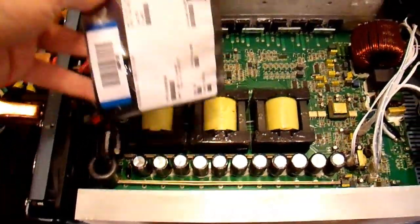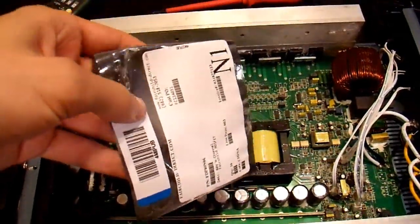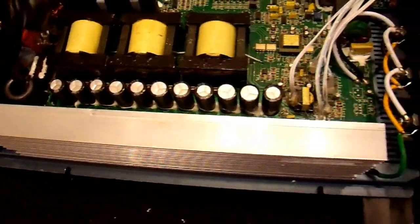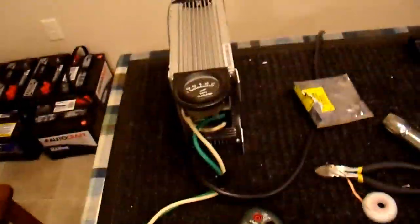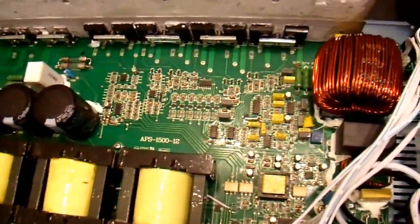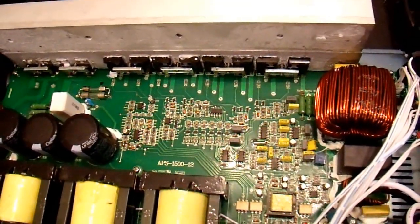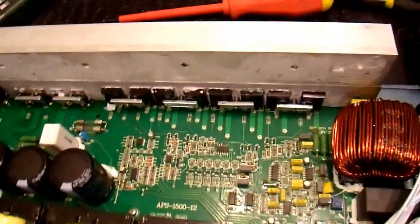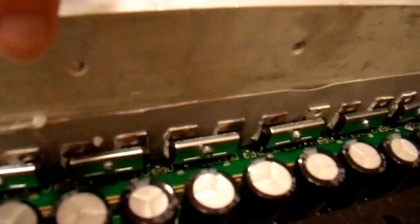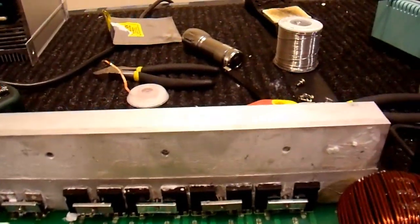Attempt number two. I replaced that transistor with another one — a different transistor but one that very closely matches the specifications, just a 60-volt N-channel MOSFET. I have it connected up the same except I put a heat sink on this time, which apparently I should have done the first time. The way that thing failed was a little suspicious — it almost looked like someone had cut the leads and re-soldered it. On this side I fixed the improper mounting, and on this side I turned that heat sink around so the ends that were bowed out are now bowed in. Everything should be mounted properly now — let's try this again.